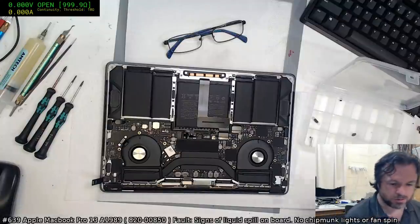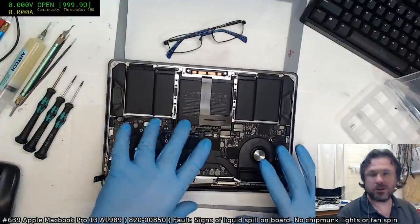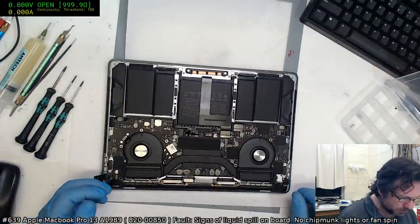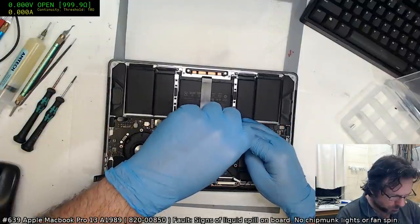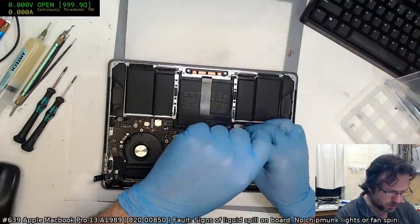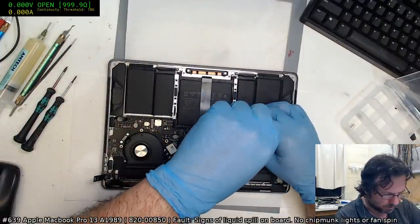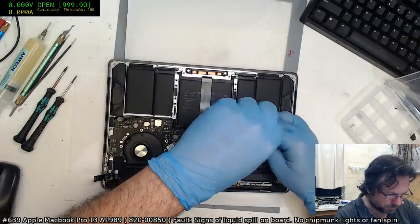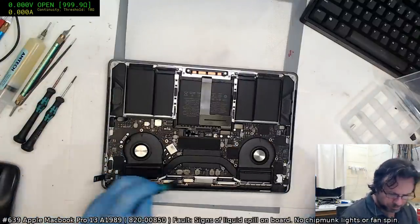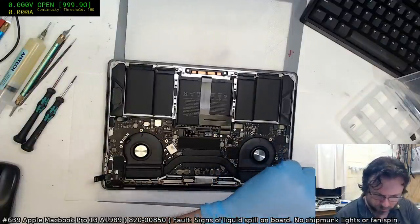Alright, that's in the process of... Ooh, there's a Pi 32 USB 2424 in there. Alright, so we have to disassemble this again. And we have to find out why we're not getting touch bar activity. Now, I have tried just randomly touching the touch bar. And no activity occurs. So whatever it is, it's more than just a case of no driver activity, as in no lighting up, and the touch is also not functional, so I don't know what's going on there. I don't really deal with touch bar faults like this, so this is a bit of new territory for me.